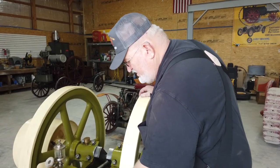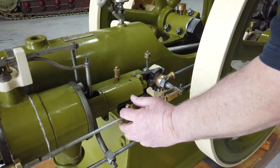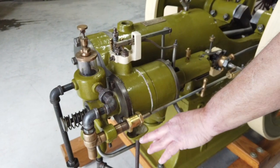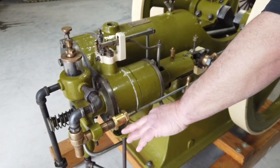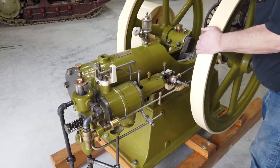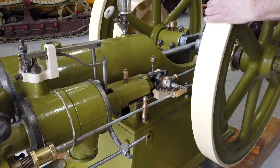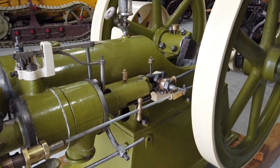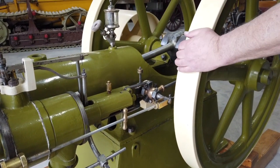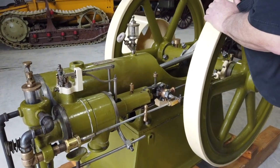One of the unique features of this engine is the star wheel here and the pendulum governor. This operates the fuel pump, and you can disengage this and pump the gas up to the carburetor - you can see it here in the glass level. It drips here and returns back to the tank. So as the engine's running, on this stroke coming back, the star wheel is turned, so it doesn't open the exhaust valve. There's no gears back here - it's all on an eccentric, so it ratchets every round, controlled by the pendulum governor.